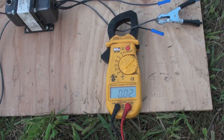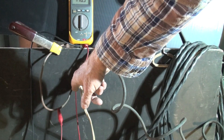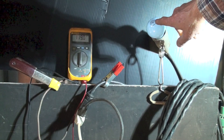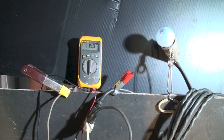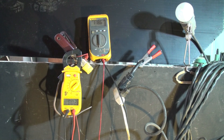Remember, this is a 75 VA transformer, so I should be able to run at least a 50 or 60 watt light bulb. Checking where the power goes in, we're running about 0.11 amps at 120 volts. Now we'll check the amperage inside the building where the load is. The wire coming from the ground rod is connected to earth ground and to one side of the light bulb; the other side connects to my copper conductor running 150 to 200 feet. I want you to note the voltage — we have 118 volts open circuit.